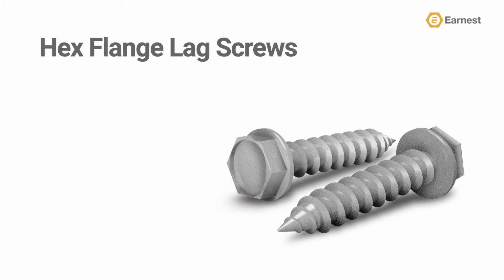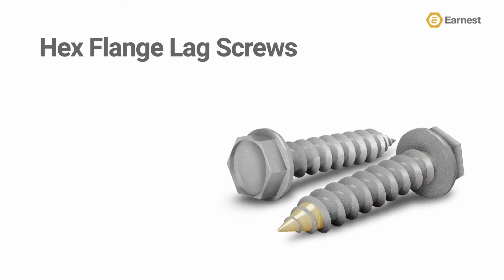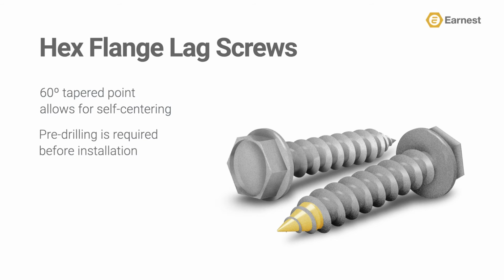Other benefits of choosing a hex flange lag screw include the wide-spaced thread, which will prevent the screw from stripping out over time. And a 60-degree tapered point, which allows for self-centering, helps the hex flange lag screw remain straight as it's driven into wood. However, it is important to keep in mind that this screw does require you to pre-drill a pilot hole before installation.